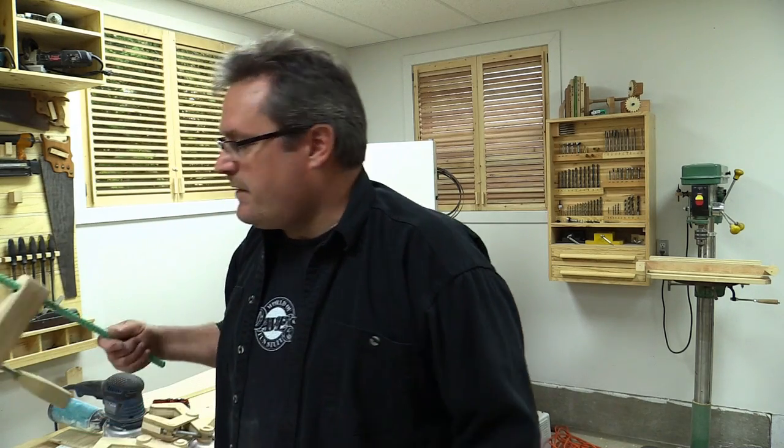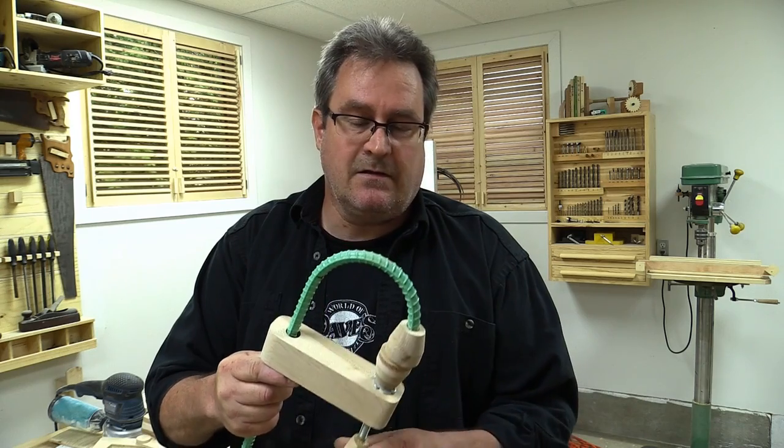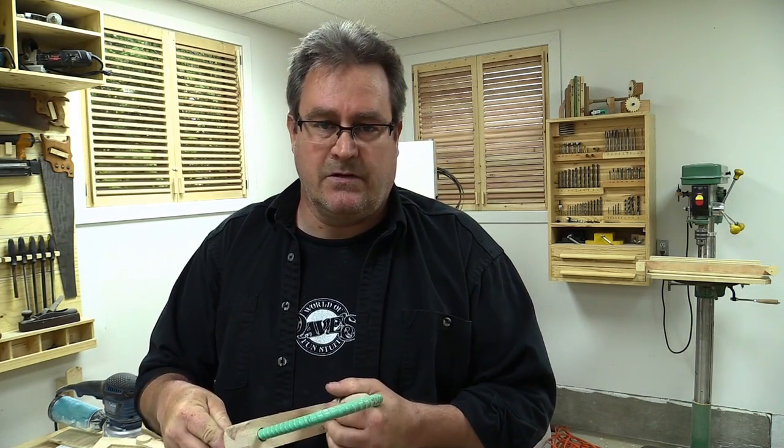Some other interesting comments in there that I picked out are, "green rebar is deadly poison, coating should not be inhaled." Well, I don't know where people get these odd ideas. The green on the rebar is epoxy, it's there to stop the bar from rusting. That's what's plagued reinforced concrete since they started making it, especially in areas where there's going to be salt used.